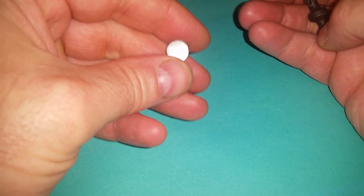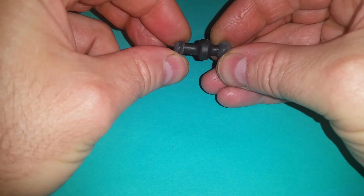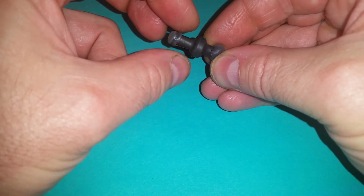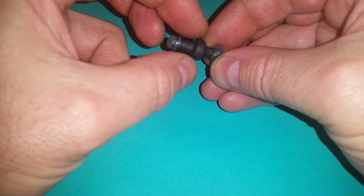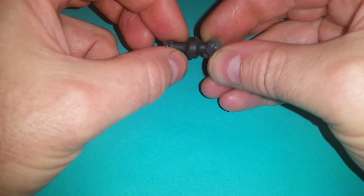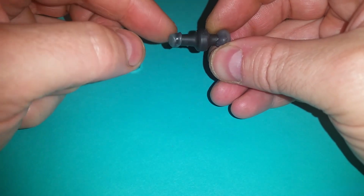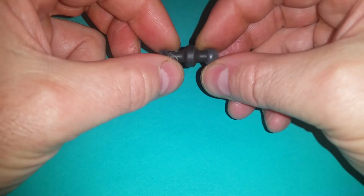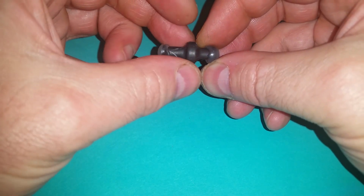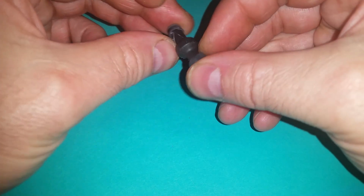So to create a stirrer, I've taken one of these Neodymium magnets and put it inside some heat shrink sleeving. Once it's in the middle of the sleeving, if you inject some hot glue in the end with a hot glue gun, it shrinks the sleeving around the magnet. Then do the same on the other side, and wrap the bit that comes out the end, because you want to make these waterproof so that the ferric chloride doesn't get to the magnet itself. That's the whole point of it, and it also makes a shape where, when it's spinning, it actually stirs the liquid.